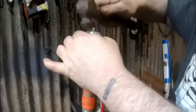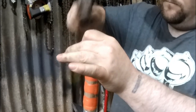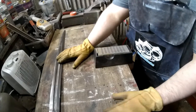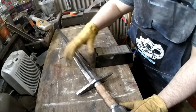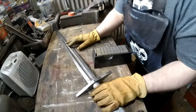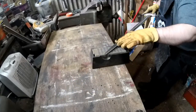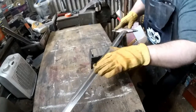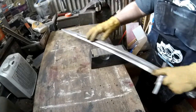I'm going to paint this side as well. So this is probably out of order compared to how people would normally do these things, but I'm going to put an edge on this now. The handle is pretty much ready to finish. I fancy putting an edge on it now, and then I can tape the blade up and not have to touch it anymore. It will enable me to blue the guard, the collars and the pommel — and depending on how I feel, I may even blue the blade. You do need to wear gloves doing this, because when you're going back across you're not putting your fingers against a sharp blade.